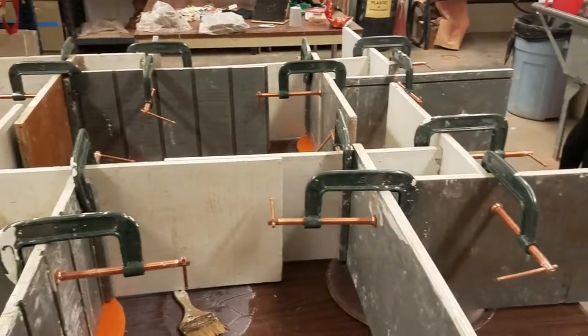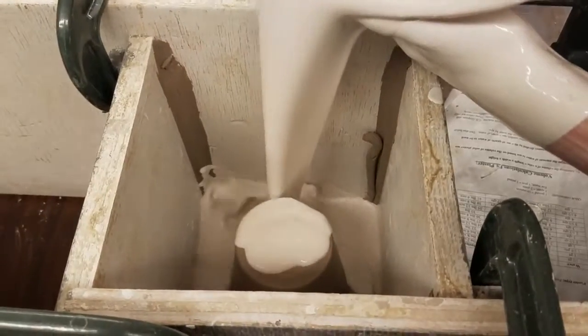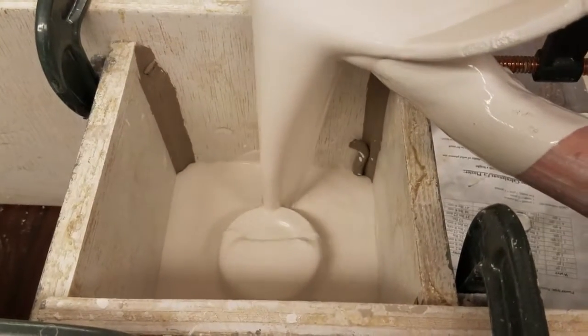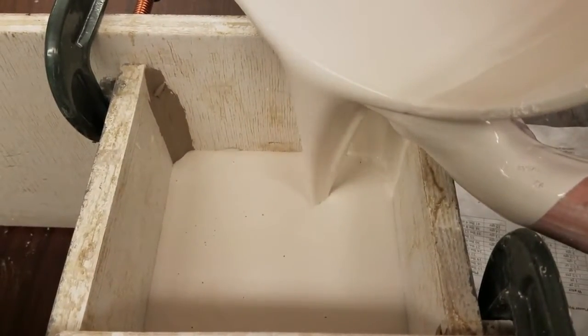Using the four clay molds that we set up last episode, place four boxes around them with clay to cover up the gaps. And then pour the plaster that we have just made into each mold to just above the clay molds that we made.